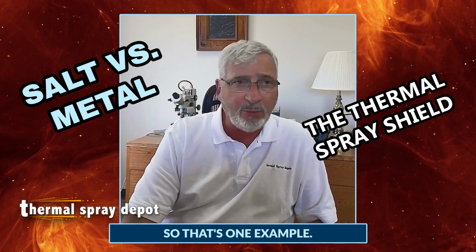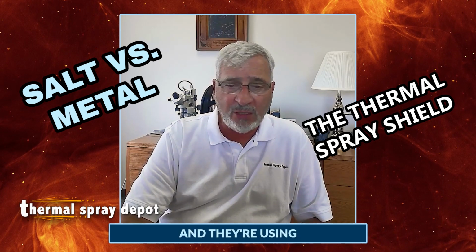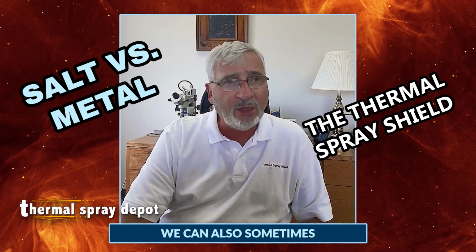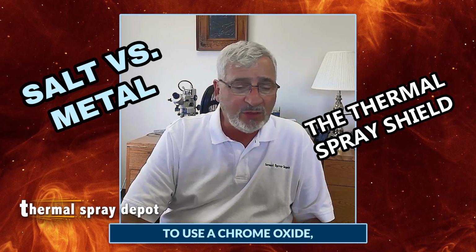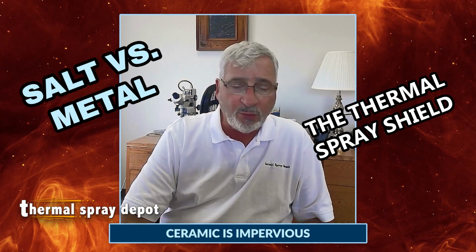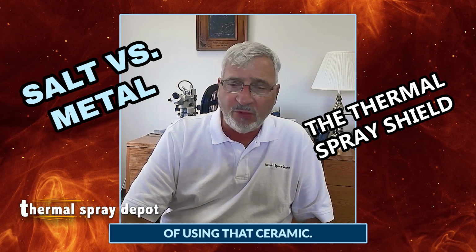So that's one example. The other one I talked about was the salt water in the mine. Well, that's a severe application, and they're using some exotic materials there. We can also sometimes use other materials. For example, that same salt mine might decide to use a chrome oxide, which is a ceramic, to protect that shaft. Ceramic is impervious to things like salt water and acids. So that's often a choice.